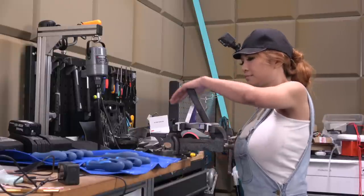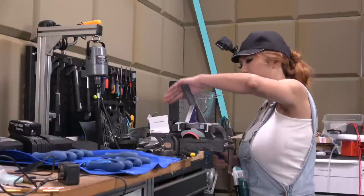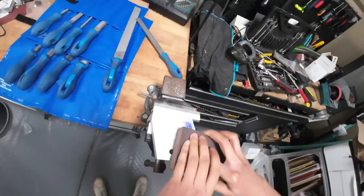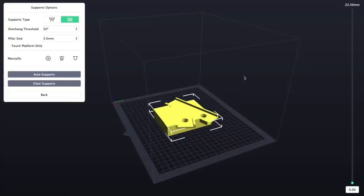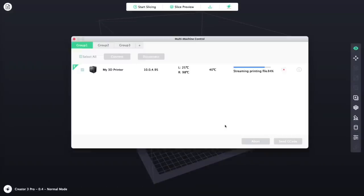I don't have the budget for a rotary table for the mill yet, so I'm just going to hand file the radius. Files are the kings of metalworking tools. Files, saws, some gauges, and enough time, you can make almost anything. Same trick again, another drill guide so I can precisely mount the part at an angle I've determined in CAD.